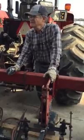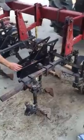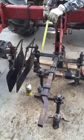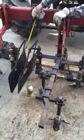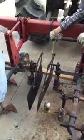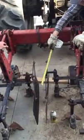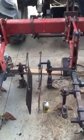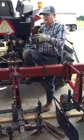What is the starting point, like whenever we get this row done, as far as the gap between these two? Okay, when you get these set in to where they need to be, oftentimes I'll have 2 inches in front, because this is opened up here about probably an inch over from being straight, and that's over there an inch farther. A lot of times mine, when I'm in operation going through the field, the back of the fenders will touch, and the crop just slips through, and nothing but crop, the weeds are gone.